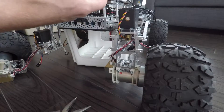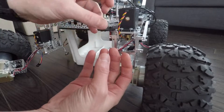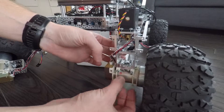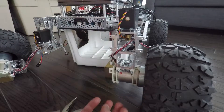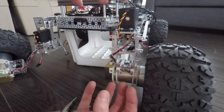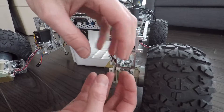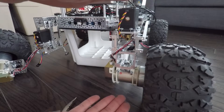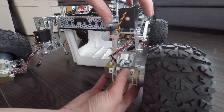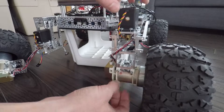If, for example, I go to pick up Rover, or he rolls over something where the ground falls out from below one of the wheels, there's going to be a pull on the shaft inside the servo. There's got to be a way to lock these down from actually separating, because the friction of a set screw isn't really sufficient to hold the pieces together vertically. It'll hold for the purposes of rotating the wheel, but not against a vertical downward force — from the weight of the tire and especially the motor — that could theoretically pull the motor out from the servo shaft.